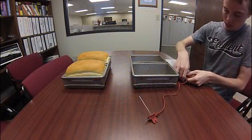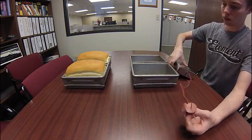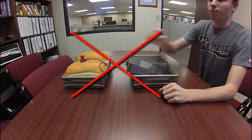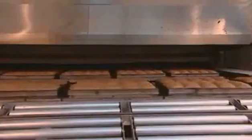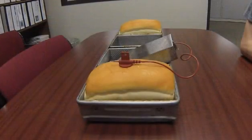We want to avoid a setup where you may have the barrier in one bread pan, as that can cause hangups in the oven or along the process where the product and the profiler are changing from a slow conveyor to a fast conveyor. It might rip the probe out of your baked good if it gets tangled in the equipment. The best way to avoid that is to have the profiler and the probe traveling together in the same pan.